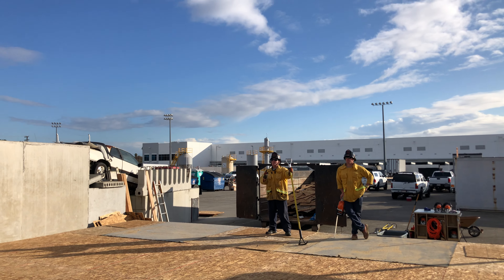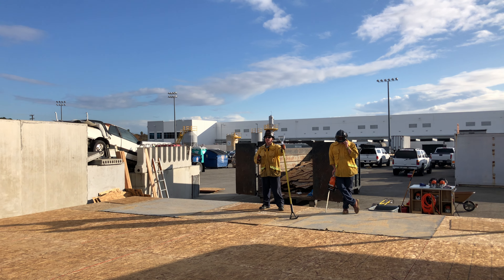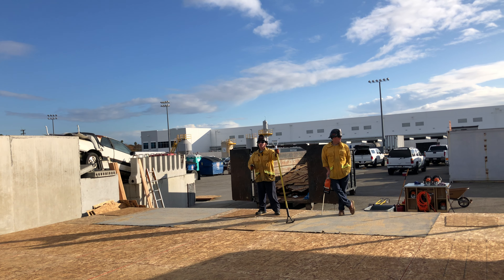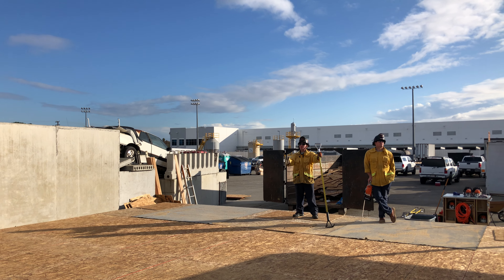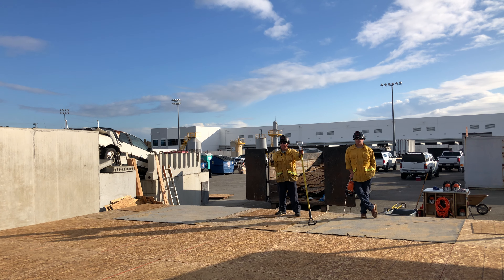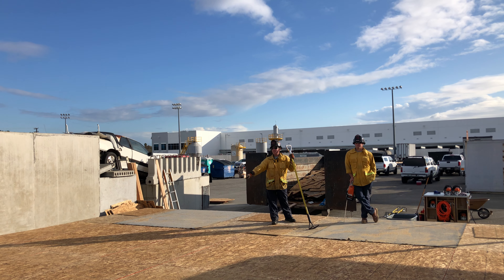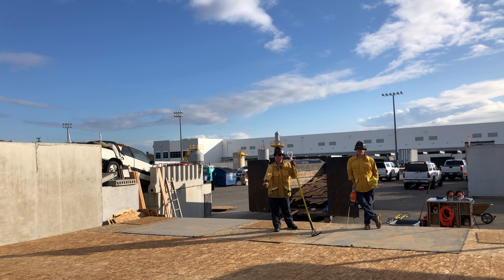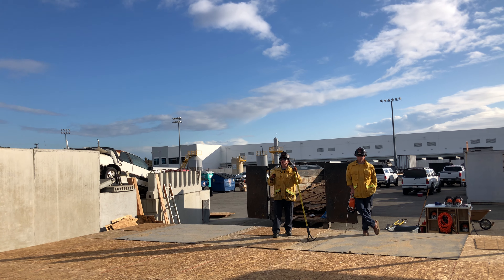They have to be on the fireside of beams and purlins, or they're doing you no good. This glulam beam is a fantastic fire stop. You will get rapid and aggressive fire movement coming down this rafter span — it will stop at that three-foot-deep beam until it builds enough to come underneath. So I can have a going-good fire on one side and get very little smoke out the other side. Make sure it is fireside of beams and purlins.